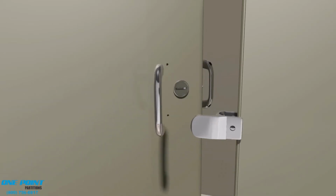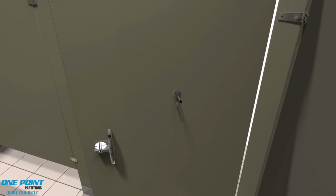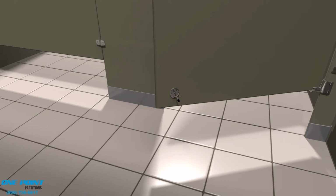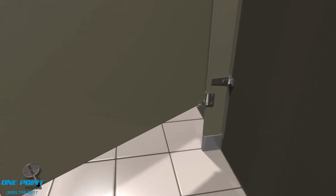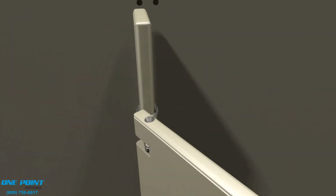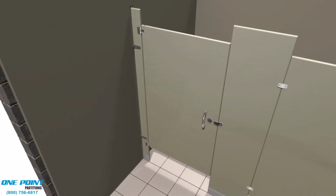to the pilaster. Right now we'll install the concealed knob set, which is an ADA compliant knob set. And next, the door pulls on each side of the door along with the strike. On the back side of the door, we'll install the coat hook and bumper, which needs to be placed no more than 48 inches above the finished floor, along with a standard door bumper. Okay, we want to make sure that the door swings without any issue, and the gap on the latch side is a decent gap. And now we can secure the pilaster to the pilaster brackets.